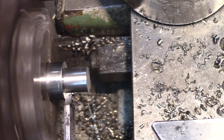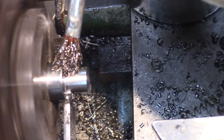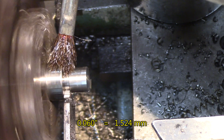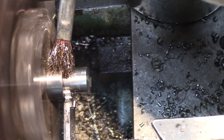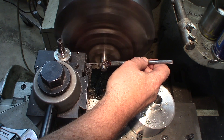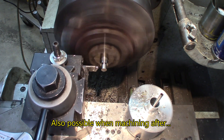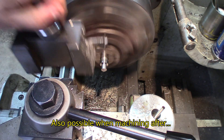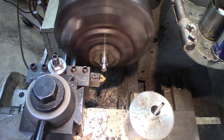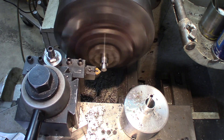I'm going on the DRO and setting tool number six, now bringing this about 60 thousandths down in there. Sometimes it goes a little smoother, sometimes a little jerkier — it depends on the material as it was fabricated. That's pretty finicky. Keep lubricating, it helps.